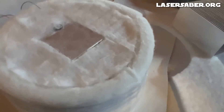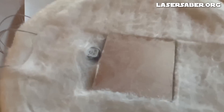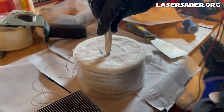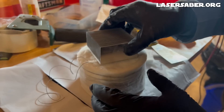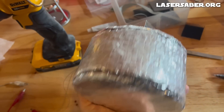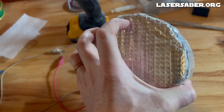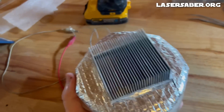The basic design idea is very simple. I start by using this white aerogel insulation to provide a good barrier between the outside environment and the internal aluminum core. Next, I glue on the heat sink, which will allow us to capture the changing environmental temperature fluctuations in contrast to the more stable insulated internal core. I then added another layer of 3D printer bed insulation around all of the white aerogel insulation, and sealed it up with a few layers of tape to make a nice airtight, well-insulated seal.